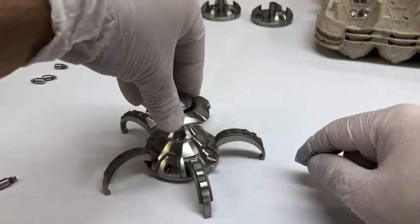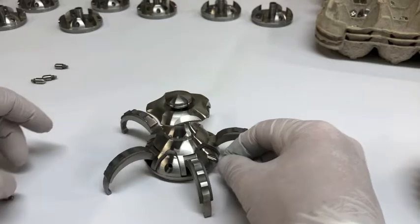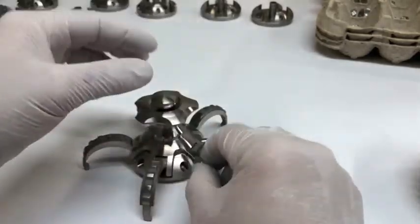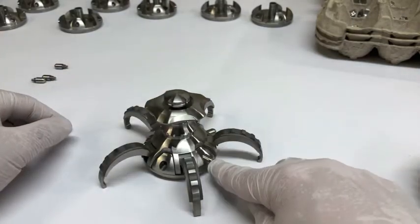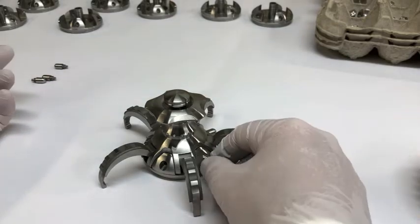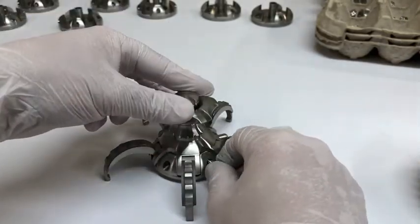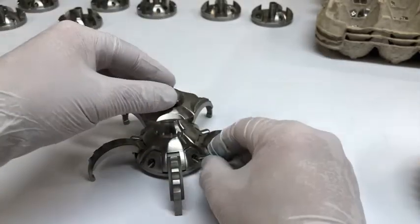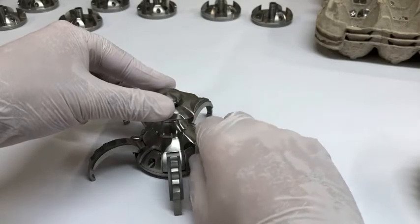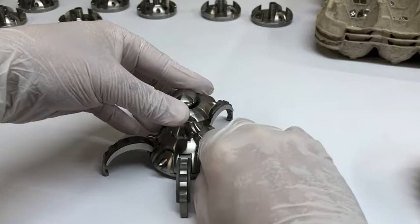I thought if this is riding up and down, there's a chance it could put friction on the correct side of that and slowly spin it out. I don't really think that's a threat. And even if one of these comes loose, it only takes one to hold this in place and there are five going all the way around. So if one of your pins comes loose, you can just grab it and thread it right back in. Since there's no real good gripping surface here, if I glued these and you decided you did want to take it apart, it would be a bit of a chore to get enough of a grip, heat it up, and then overcome the threadlocker. I think better safe than sorry and omit the glue. There are definitely cases where I would go the other way, but in this particular case it's such an easy assembly — I think you guys are going to enjoy this better if you can take it apart. Five more pins, or five little thread-ins like that, and then she's done.